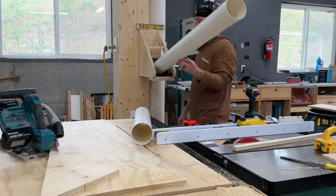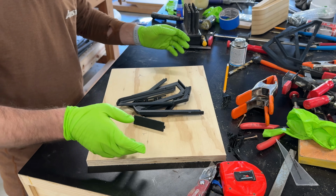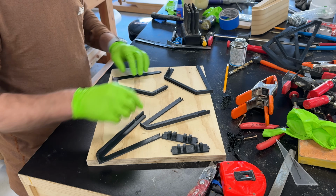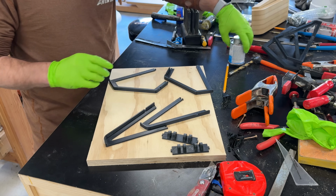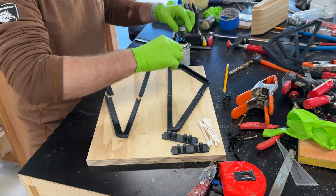With the mounting bracket installed and some scrap pipe fixed into the rotating pipe clamp, I started building out the dust hood assembly. Due to the size of the parts, it required me to get creative and print them in multiple pieces that could then be easily assembled to finish out the final product. I used a combination of these puzzle piece tabs and a dovetail-like joint you'll see in a future part. This makes it simple to ensure all the parts can be lined up correctly during the assembly, along with adding some strength.